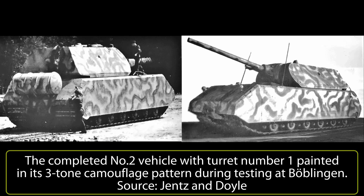There had been problems, the sort of things expected in trials, requiring changes to a few features such as periscopes to improve visibility, the driver's seat, ammunition stowage, the traversing mechanism, and those original wheels which had failed. The engine had also not worked as well as was wanted and was suffering valve damage, although it is not clear if this was a manufacturing problem or as a result of stress in the engine during testing. On top of this, the original 1,100mm wide flat plate track had proven unsuitable and was replaced with a new track plate with removable ice cleats which were produced by Škoda.